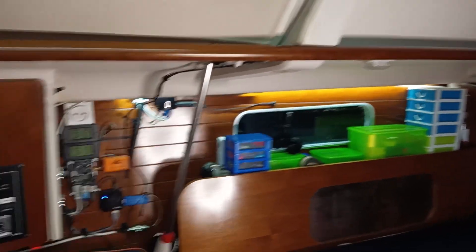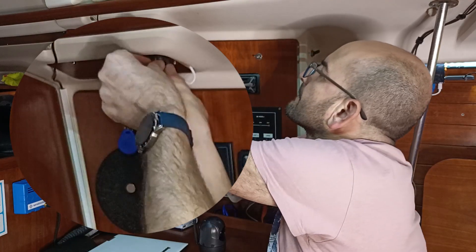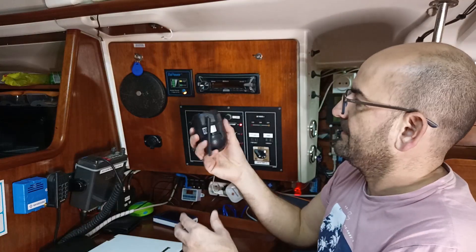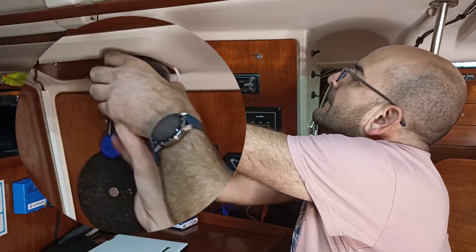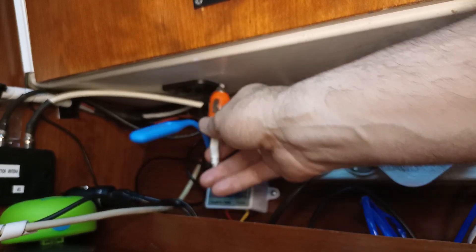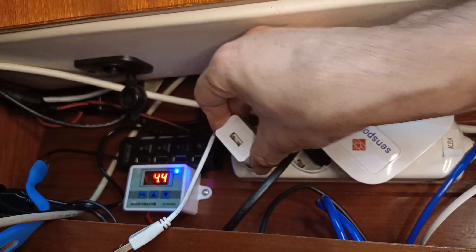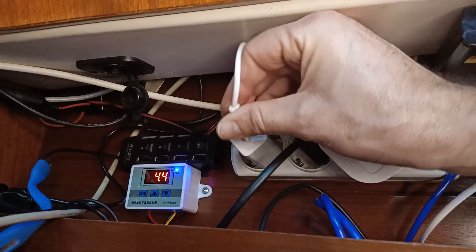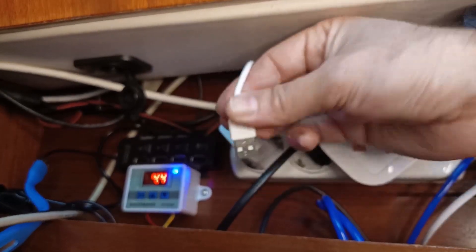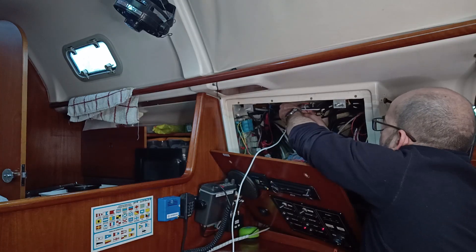Installing the camera will also be straightforward. We'll look for a good position from which most of the boat's interior can be observed — we will place it above the chart table, which has good visibility and is out of the way. Once we've found its location, we'll power it up. We have two options: plug it directly into a 220V outlet, or plug it into a 12V USB charger connected to one of the boat's cigarette lighter sockets. If we use the 12V option the camera can always function even when we're not connected to the port. In my case I've decided to plug it into a 220V outlet, so when the boat is not in port the outlet has no power and the camera turns off automatically.